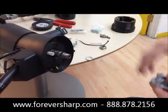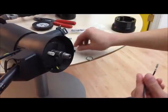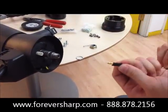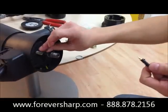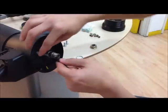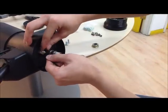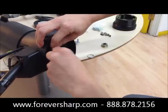Your first step, you're going to want to grab the bell shaped wire and the black plastic sleeve, and you want to slide the sleeve down into the wire. Now you want to grab the spring and insert the spring into the contact housing. Now stick the bell shaped end down into the spring, push it all the way down and then make sure you turn it right to make sure it locks in place.